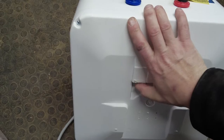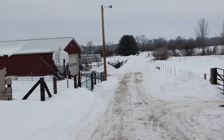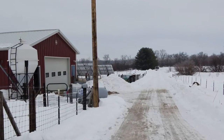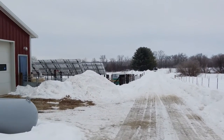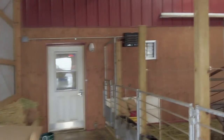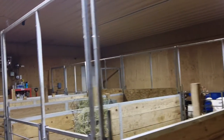This is the back where you put the wall mount into, so I'm just going to haul down my tools to get this going. I did the unboxing up in the shop so I could figure out the fittings. Down here in the goat barn, everything is plumbed with garden hose fittings. This particular unit has a half-inch NPT connection, so I just had to go to Menards and get two fittings — female on one end for the half-inch NPT and garden hose thread on the other end — so I could hook right up to it.